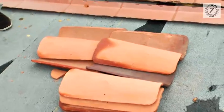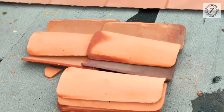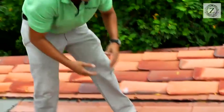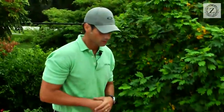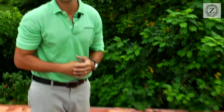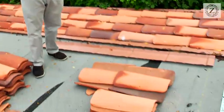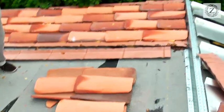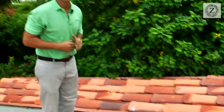This creates a very beautiful, very traditional look. But what happens is it's a lot of tiles, a lot of areas of attachment, and eats up a lot of materials. If you don't know what you're doing and you're not cautious, you can do some pretty horrible installations. Interestingly enough, with this product a horrible installation is okay because this has that room for air — not like your standard machine-cut tile, S-tile, or flat tile.